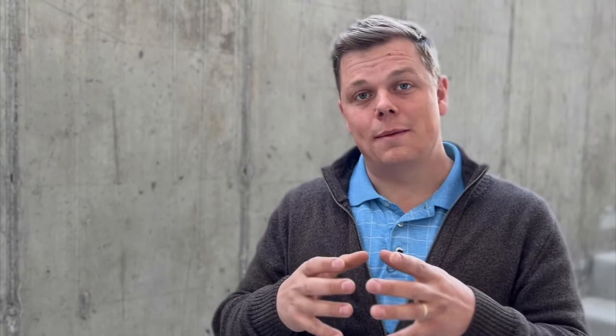Underneath the drain there's a grill and it funnels down into plumbing piping. We pipe that down into a container — that can be a five gallon or ten gallon container. Sometimes we use a 20 gallon container depending on our needs, but typically it's five gallons. In that five gallon container, we drill holes on the sides and on the bottom so that when water gets in there from the drain, it fills up and drains out the sides.